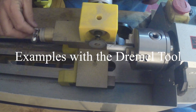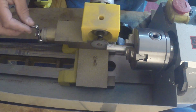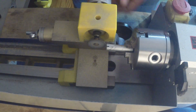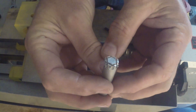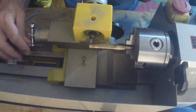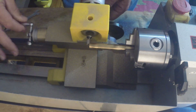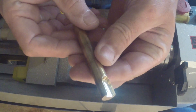Following a few parts being cut with the Dremel tool, the remaining outside pieces are removed with the lathe. Next, a slot is cut with an end mill cutter doing about 250 microns per pass, shown at double speed. This shows the slot after milling about five millimeters deep.